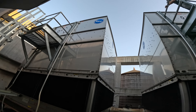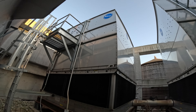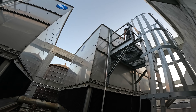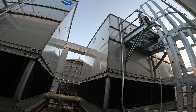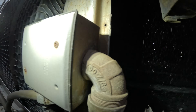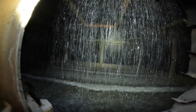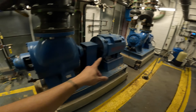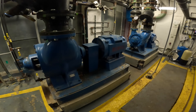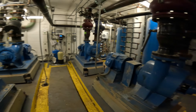So that's the cooling tower. Those two water hoses you saw connected to our air conditioning system — the way we're ejecting heat is through water using these cooling towers. Water's being pumped throughout the entire building and we've got some giant fans up there. This is a whole different lesson, but it's pretty cool. These are the condenser water pumps — we're pushing water through these condenser water pumps through all of our air conditioning systems and to that cooling tower. We're going above about 38 floors, circulating water. I do have a video doing maintenance on these pumps as well.